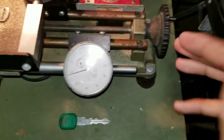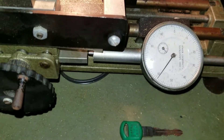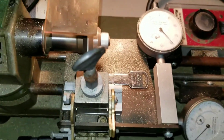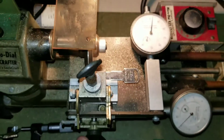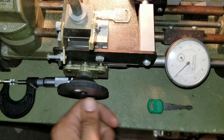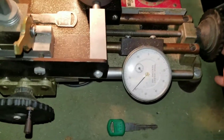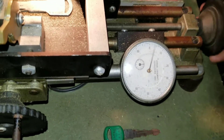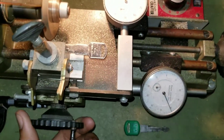Next cut will be a 2 at space 861, depth is 290. We're going to skip the next space and just go to the last, which is at 1045 — that'll max out the space micrometer, that's as far as it goes — so we'll hang it and put in a depth 2 at 290.